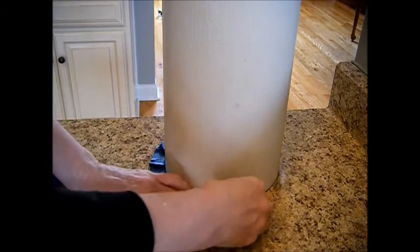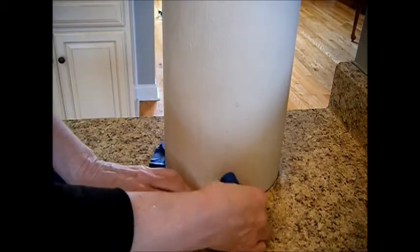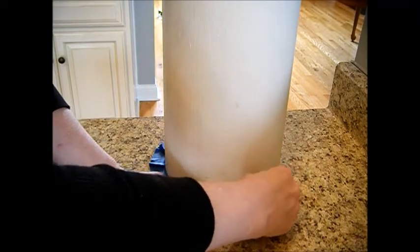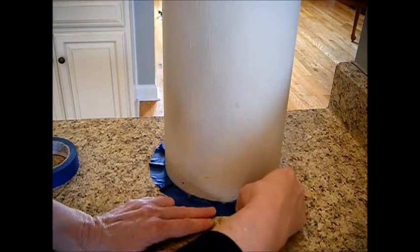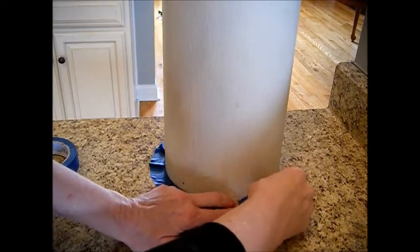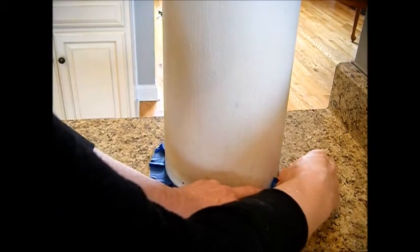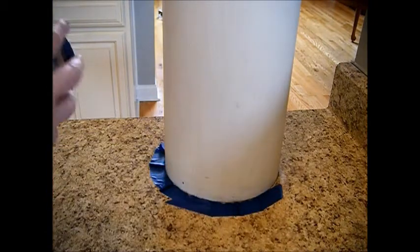Because we don't want to get any paint on this solid surface, what we're going to do is give it a pleat. About every three quarters of an inch, you're going to come back on itself at an angle and give it a pleat just like that. It is that simple. Coming around, I just pinch it like that, hold it down like this, kind of run off to the angle — and see, I have some nice pleats going that way.